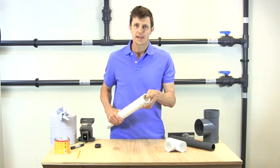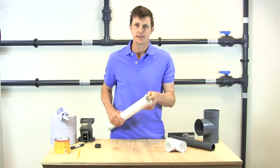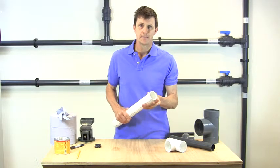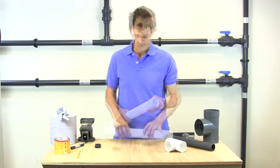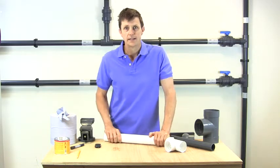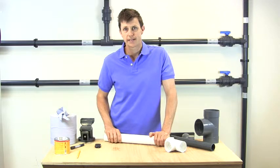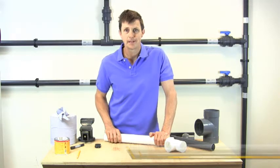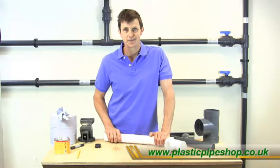Although the inside diameter is nearly perfect, it cannot be absolutely guaranteed as much as the outside diameter. Which is why we often tell people that yes, this is what the inside diameter is likely to be, but the tolerances are less than they are for the outside diameter. If you look on our website, there are tables for wall thicknesses and outside diameters of all of our metric and all of our imperial pipe. That's on www.plasticpipeshop.co.uk. Thanks for watching.